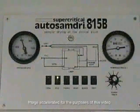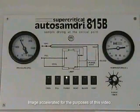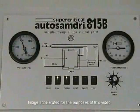From this point forward, the AutosamDry 815B will automatically cycle through all the drying sequence steps until the process terminates. When the 8-minute fill mode expires, the 815B will automatically advance into the purge mode, indicated by the illumination of the purge LED. During this point of the cycle, the 815B will remain in the purge mode for the duration of the time preset by the operator via the purge timer. The alcohol coming out of the 815B chamber exhaust hose will be collected directly into the solvent condenser. Upon completion of the purge mode, the unit will automatically advance into a post-purge fill mode, in which the chamber fills with liquid carbon dioxide.